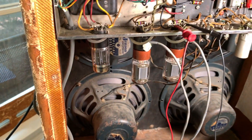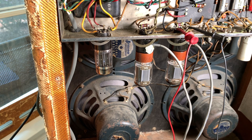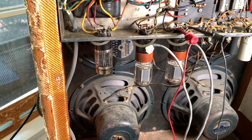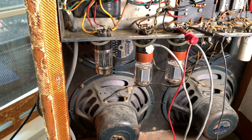Let me explain this to musicians who don't know much about amps: if the tubes start running too hot, these gray plates right here will glow red — literally red hot. If they're doing that, you're damaging those tubes and they should never run like that. Even running hot without red plating will wear the tubes out faster. So I'm glad I checked it — it's drifted a little too high and I'm going to have to lower it.